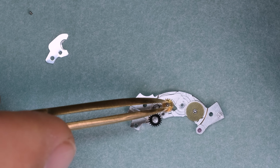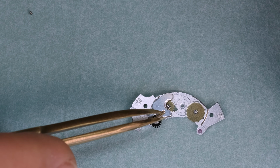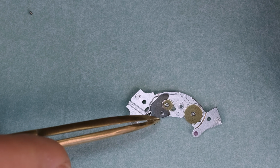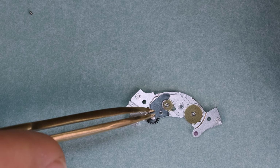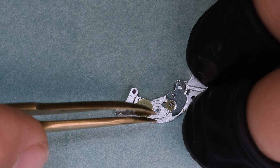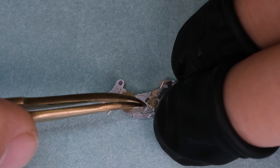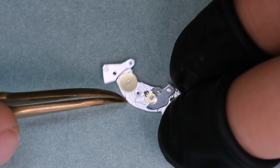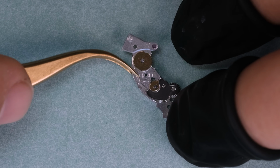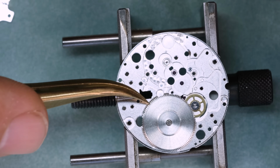We're putting the automatic module back together. Whenever I say that, I kind of want to say we're putting the band back together, but we're not. The whole automatic module is underneath the barrel bridge. Well, there is one wheel on top of the bridge, but it's all part of the bridge. And this not very elegant click spring, but it does work. So with that ready, we can start building the movement.